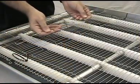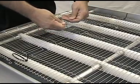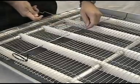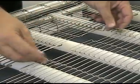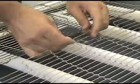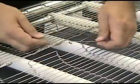When you are sure that your strand is right side up and matches the alignment of the strands in the belt, firmly grasp the belt strand edges and bend it away from you as shown. Then insert both ends of your splice strand through the two spaces on either side of the center belt on the joint end of the belt. Once you're through those spaces, put both ends of your splice strand through the center space of the opposite joint end of the belt, then pull the strand through until the center space locks.